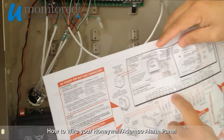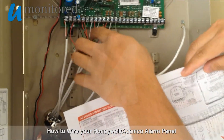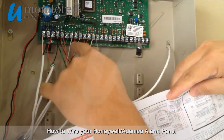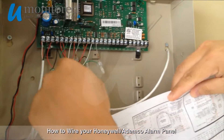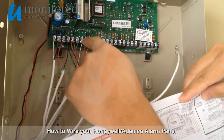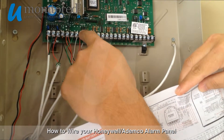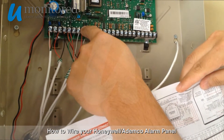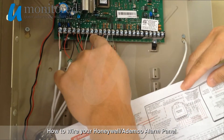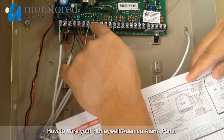8 and 9 is zone 1. Basically it's a loop — the signal gets sent through here, then comes back in. So from 8 to 9, basically it's just a loop. Through the resistor? Yep, that is correct. 8 and 9 is one loop.